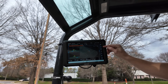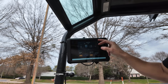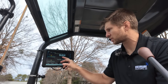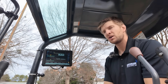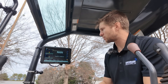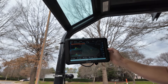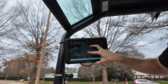The next icon down from the top right is your bucket selection — if you have multiple buckets you can calibrate them and then switch between them. This icon switches from 3D view back to 2D view, which is useful if you don't have the full pro system and are just using in-field layout. You could build a surface the same way you do in EasyNav and it'll give you your cut fills — say you're on a job site without a CAD file or surveyor stakeout, you can run it in 2D mode. You can also pan, rotate, and pinch to zoom the screens.